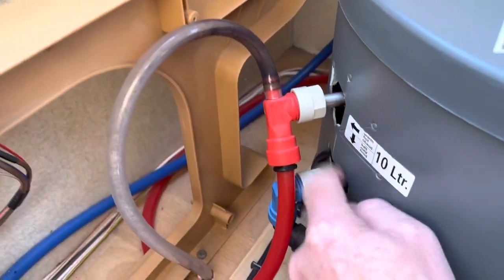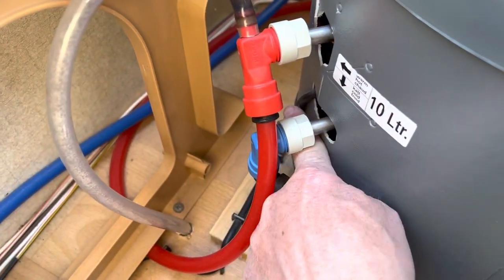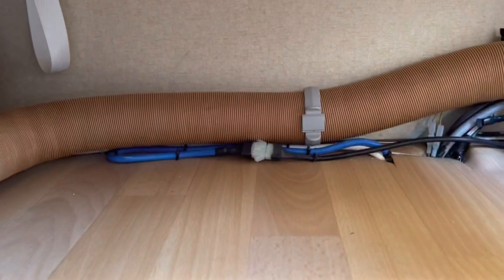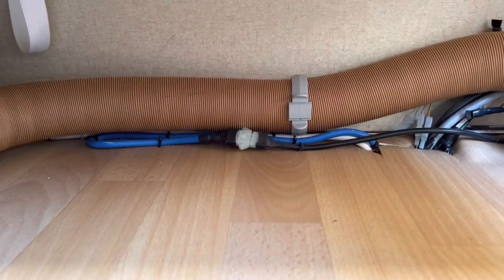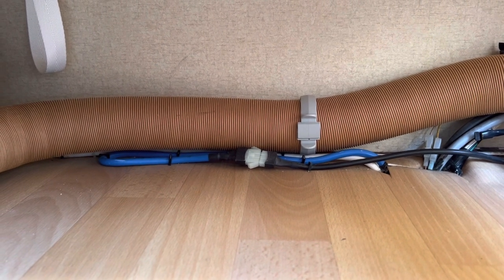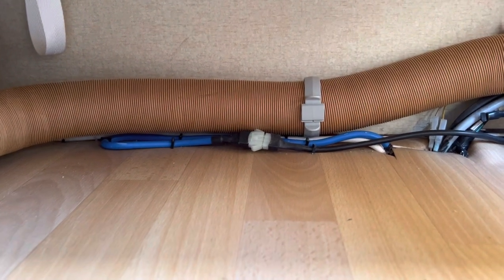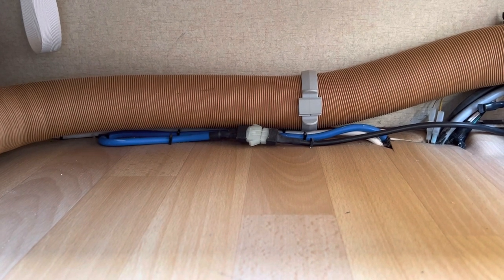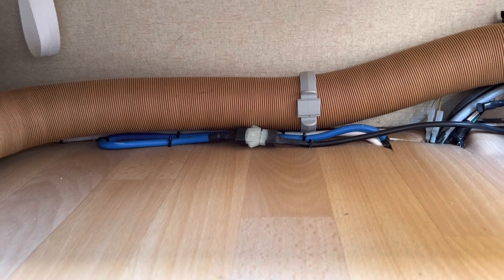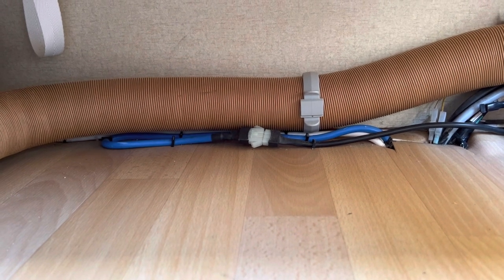What you have to do is find the heater element — which is there — and there's a wire that comes out of it. Follow that wire around; this one goes under here, and then find the connection that connects the water heater to the rest of the system. Nine times out of ten it's in a coffin-shaped box which you can pop off.